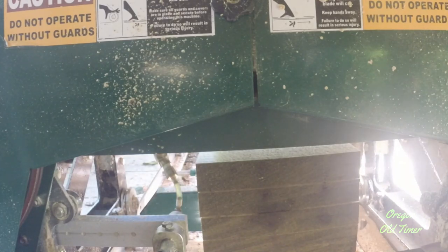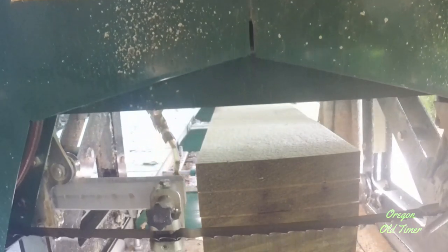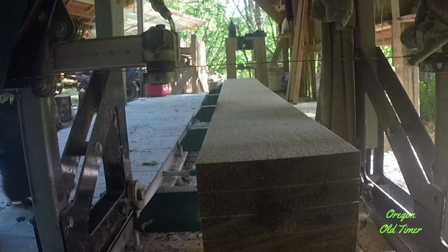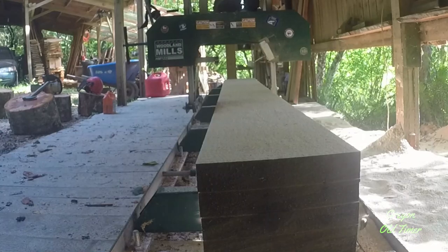Watching this, looking for signs of arching, and I think I finally see some. Not enough weight to hold down the cant back. So I'll take these off, flip the remaining cant, and make the last cut.